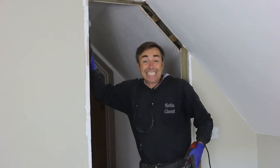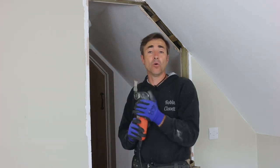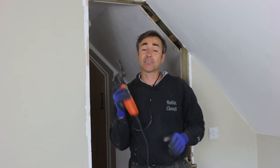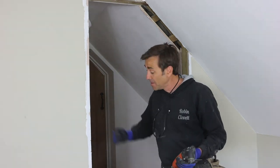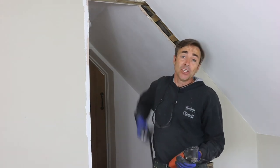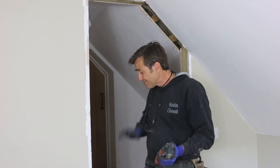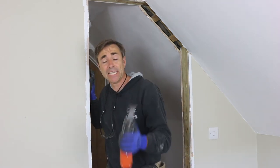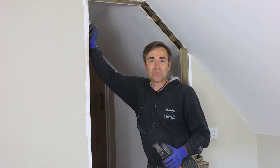So that's the easy way to take out a door lining. I used the multi-tool with a 44mm blade from the Purple Series — it's a Starlock blade. It's a simple matter of cutting a slot through the middle, knocking it out, using your claw hammer, pull the frame out. It takes a few minutes and it's a really simple clean job — something I like to do when I'm ripping houses apart.